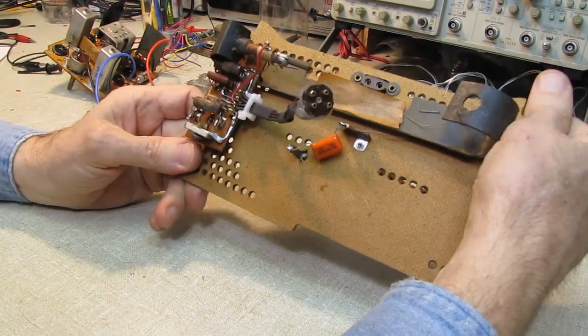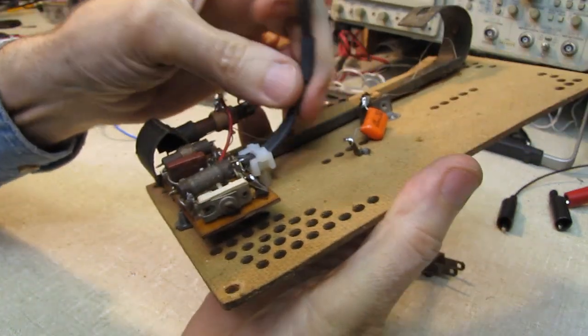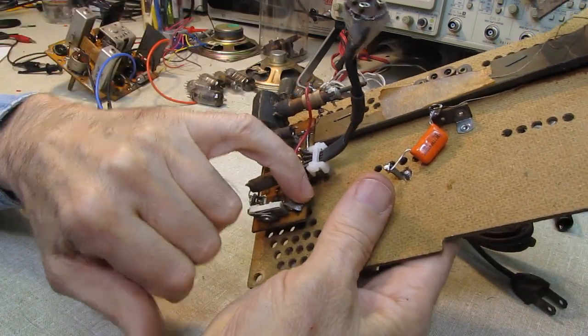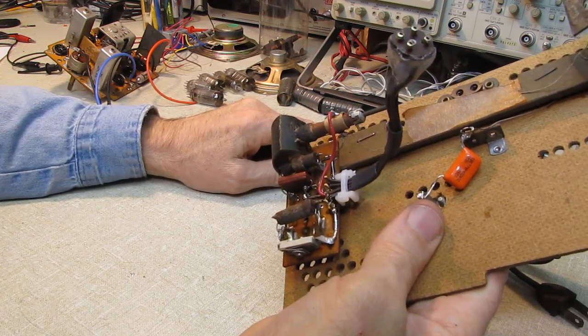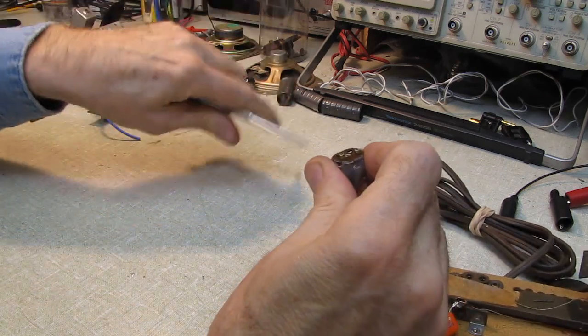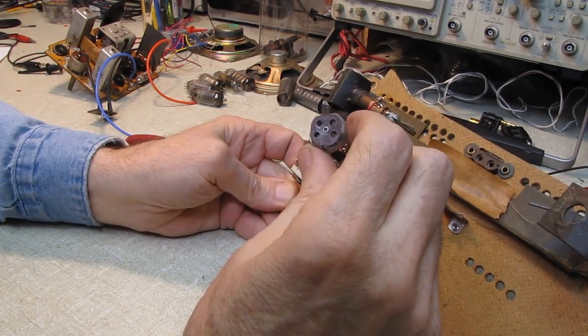And we have the daughter board repaired. We've put some strain relief here. Originally this is actually rotor cable that they're using, and it's the same thing in the picture on the SAMs. But there were no eyelets in the board where this was soldered in, and from being handled, pulled in and pulled out, all of these traces had been lifted off of this board. And this plug was broken. In fact, I forgot to pull the little pieces out of here that I used to line up the connectors, or the pins, or the sockets for the connector, when I glued this all together, just to make sure everything lined up.